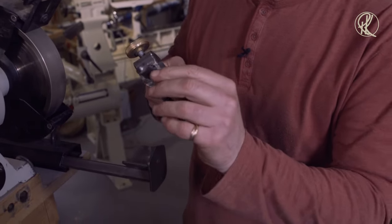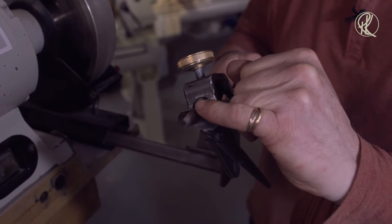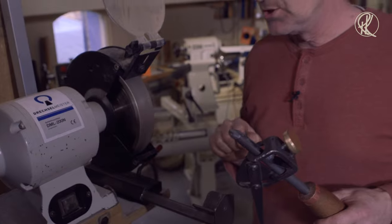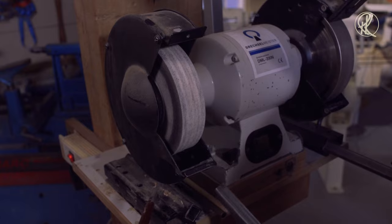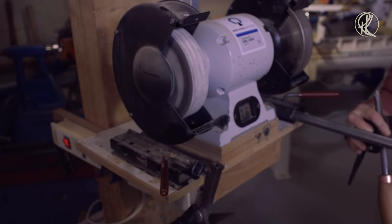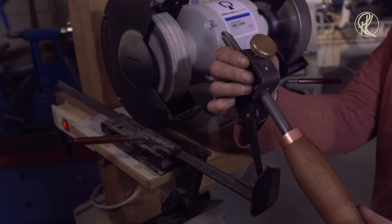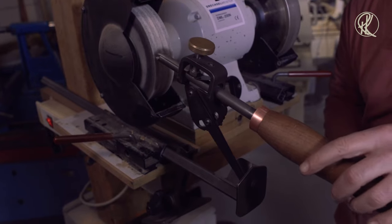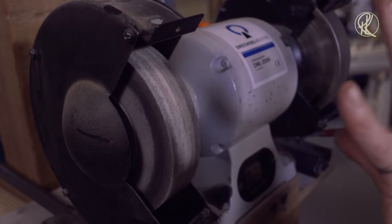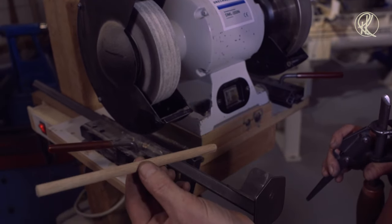I stop the wheel with my fingers because otherwise I'd still be waiting. As you can see, I have a very nice bevel — only the top of it, right? The rest is just taken away. That's my smooth bevel — what I can do on a CBN wheel. If I would do the same thing on the aluminium oxide wheel and clamp the V-arm there, I get a totally different angle, because that wheel gets smaller every time I grind.